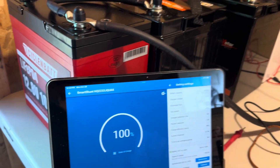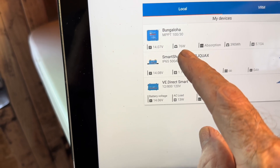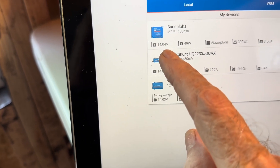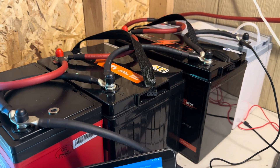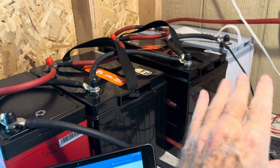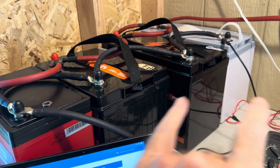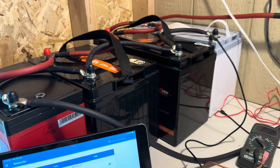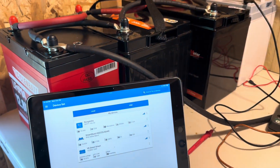100% state of charge in absorption now. 83 watts is all that's coming in off those panels and the voltage has dropped just a little below 14.2 — as the sun pops back out it'll push it right back up. I'm not seeing anything weird about hooking these up in parallel. This is just an experiment to see how it worked, and everything looks like it's working well. With steady wattage coming off the solar panels, everything read absolutely identical.